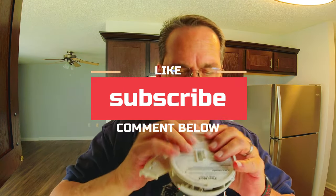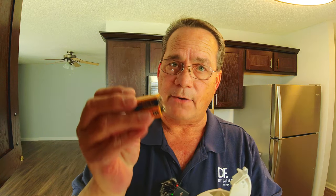On the sides of these smoke alarms you can see that it's open — that's so smoke can get in and go across the sensor. What I like to do is blow into these openings all the way around to get out any dust that may have settled on the sensor, any spider webs, whatever is inside on that sensor. Once the inside of the smoke alarm is clean — somebody might like to use canned air — go ahead and get your new 9-volt battery, pop it into the smoke alarm, close the door, and you should be good to go.